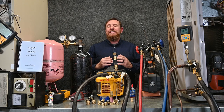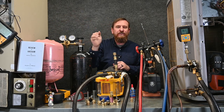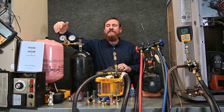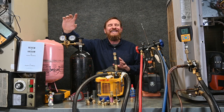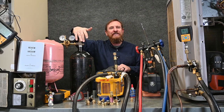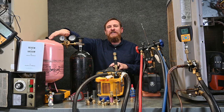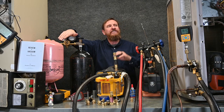Now that we've proven we're in a low enough vacuum with our decay test or isolation test, we're ready to add refrigerant. We have to get the refrigerant from the tank to the connection. Some people like to purge that hose using the refrigerant to push those contaminants out; I personally like to pull a vacuum through that hose all the way to my tank. Whichever method you use, make sure you're getting it as clean as possible — all the contaminants in that hose can be pushed into that system. As we're adding refrigerant, we want to make sure we're adding it to the liquid line, so that liquid refrigerant is going to the liquid line and boiling from liquid to vapor. We only want vapor coming back to the suction line to protect our compressor.